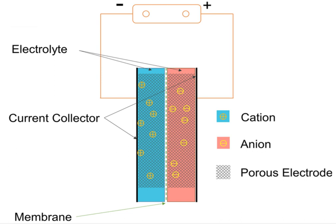The stability results from the dual electrostatic and electrochemical storage principles. The specified charge and discharge currents can be significantly exceeded by lowering the frequency or by single pulses. Heat generated by a single pulse may be spread over the time until the next pulse occurs to ensure a relatively small average heat increase.